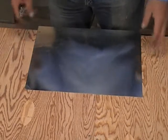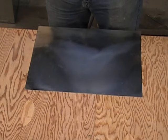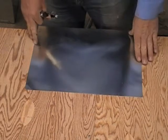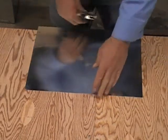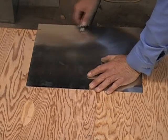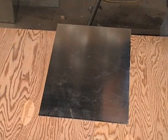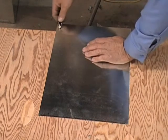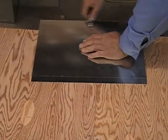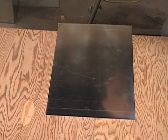For layout fitting number 9, which is going to be the bottom exterior door, first we set the scribe to 1 inch. Our layout piece is 16 and 7/8 by 12 and a quarter of 26 gauge. With the scribe set at 1 inch, make your mark, reset it to 1 inch and an eighth, make your mark again on the sides and top, then reset it to 2 and a quarter.